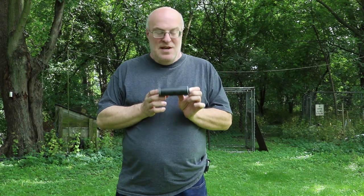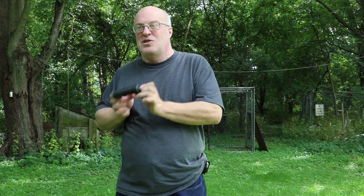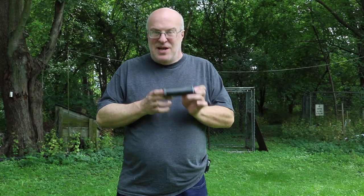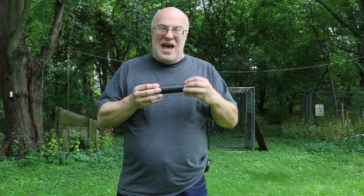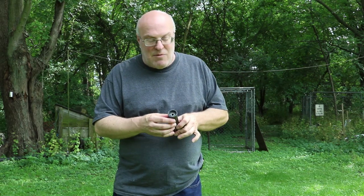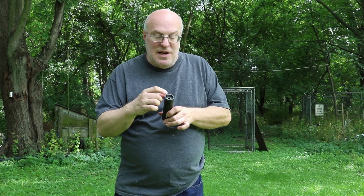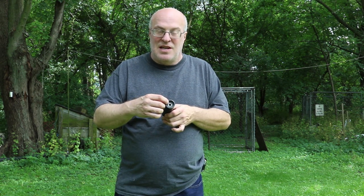Hi, my name is David. Chris encouraged me to come on camera for a second to discuss the suppressor. With the real suppressor, it was called the Mark 3 Mod 0 by the Navy. When attached to the pistol, the whole system was called the Mark 22 Mod 0. If you go to my documentary about the Hush Puppy pistol on YouTube, you can hear all the intricate details. With the originals, you could unscrew the back end — which had threading on it — and also unscrew the front end. At the front end there's a recess, and inside that recess was a disc with an annular ring on the outside.